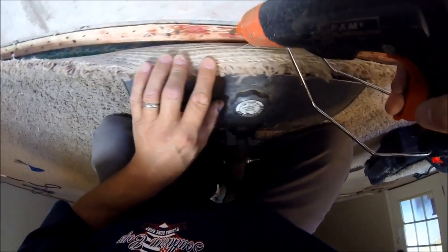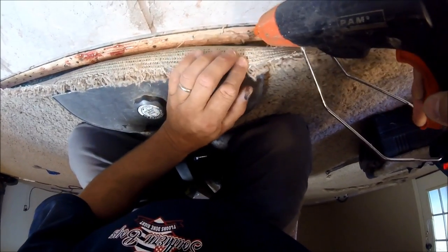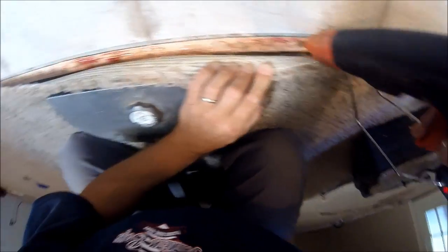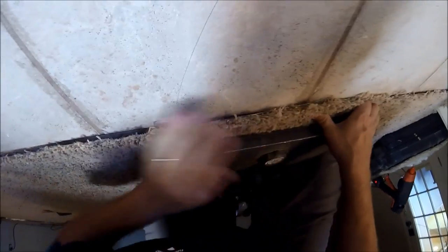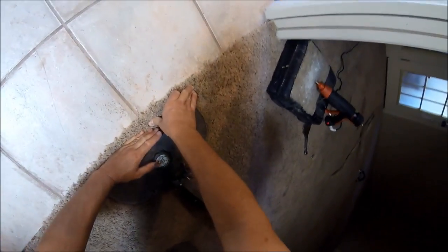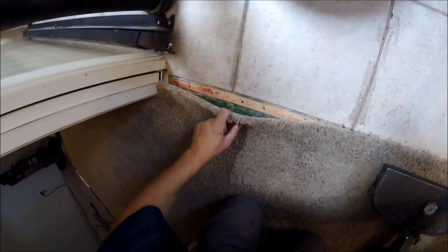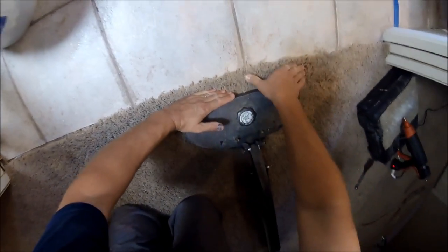This is going to strengthen the back of the carpet since it's all chewed up like that. After I get this done, I can squirt some latex sealer down in the gap before I trim it and tuck it. I just want to hold that on there for a couple minutes to make sure it gets good and stuck before I let off the stretchers. The rest of it ain't going to take much pressure — this end is pretty good. The worst of it was the center, so that's why I chose to start there first.